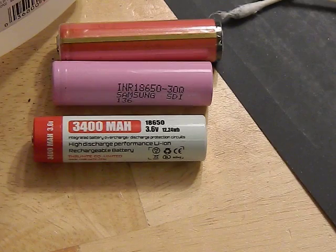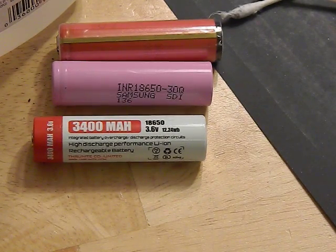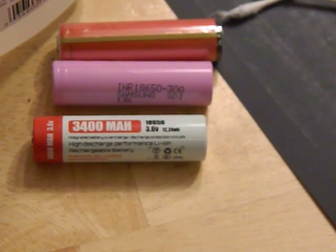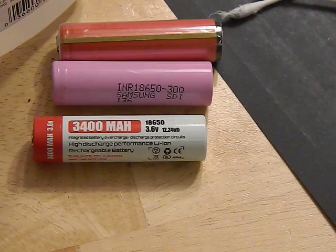One characteristic of lithium-ion batteries: they don't drain gradually — they drain and then just bottom out. The flashlight is bright, then suddenly it's off, or it dims very quickly over about a minute. This is different from alkaline batteries, which can take 10-20 minutes to wind down. For unprotected batteries, as the voltage drops you'll notice dimming and can switch to a lower mode for emergency light. With protected batteries, once you trip the circuit, it just cuts off completely — no warning.